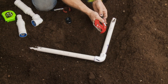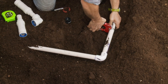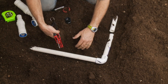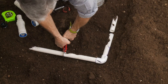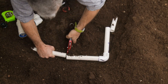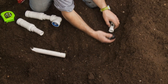So I'm going to cut the pipe back where I marked it, at 10 inches. It's not easy all the time, actually, with a light duty cutter. So I've cut that out, and I'm going to cut this side out as well. And I remove that whole piece. What I've got left here are two pieces of mainline 1-inch PVC pipe that I need to connect to re-establish the mainline in the sprinkler system.